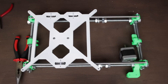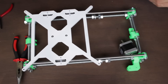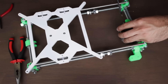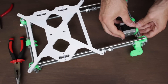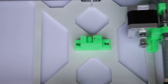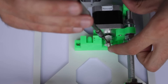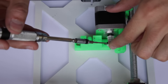Next we just have to install the Y axis NEMA 17 motor in place. For that we will pre-install the two 10mm M3 screws in the holes, then present the motor in place, and after tightening it we'll put the Y motor distance 3D printed piece in place as shown on screen. Once everything is in place, we'll tighten the screws, then install the GT2 16 pulley. To adjust it properly, flip the Y structure and adjust the pulley completely centered with the Y belt holder we installed before, then tighten the two little screws.